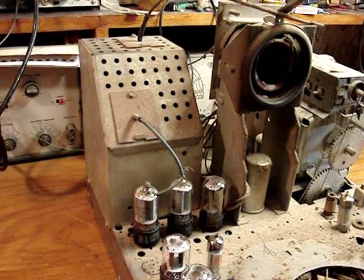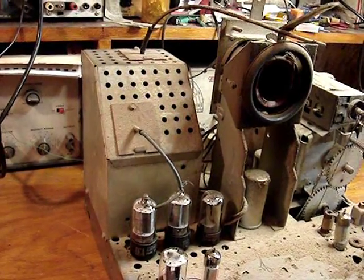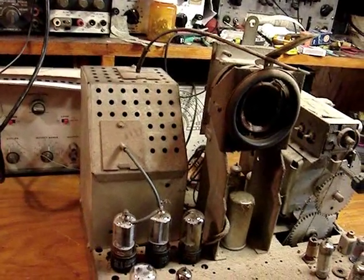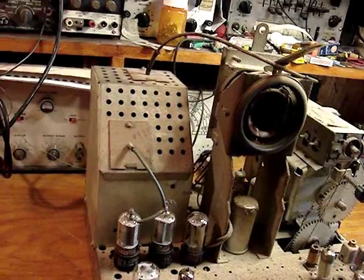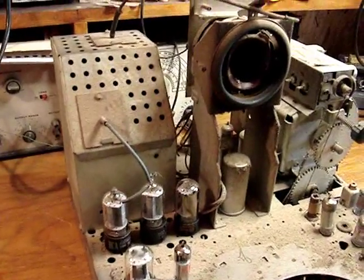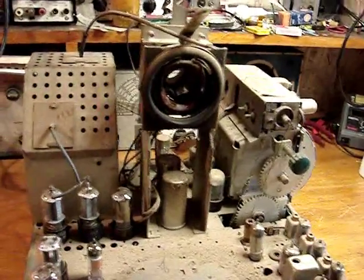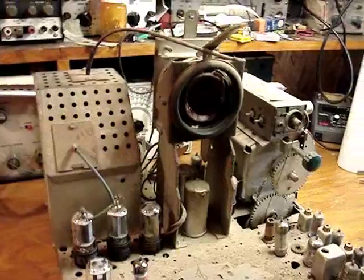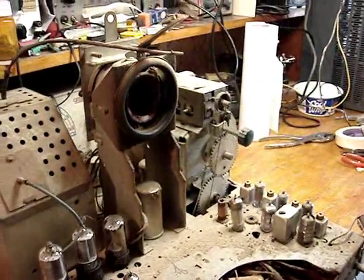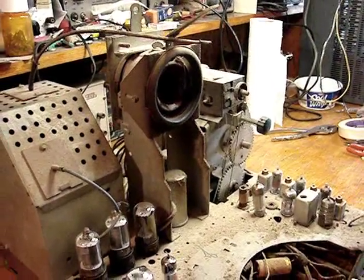But anyhow, I'll have to see if I can get a flyback ringer or at least test the DC ohms. I think it's listed in the ohms that the winding should have in the SAMs folder I have. Anyhow, now I can tip this set up on its side and take a look at the capacitors. It's already a given that they're all going to be replaced, with maybe the exception of the mica caps.